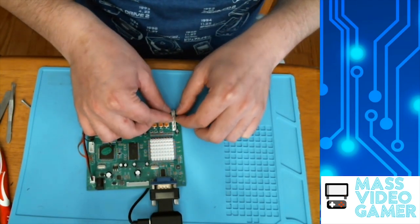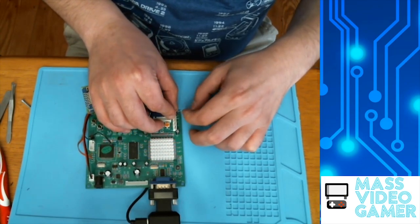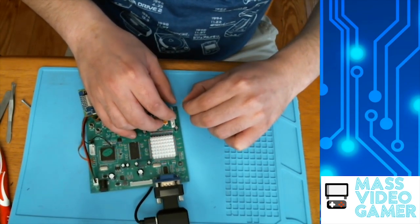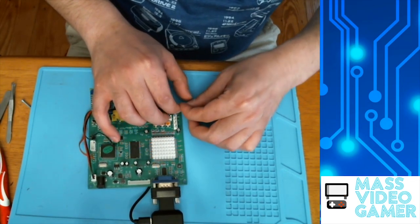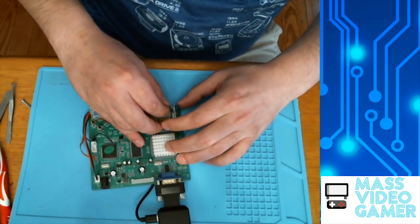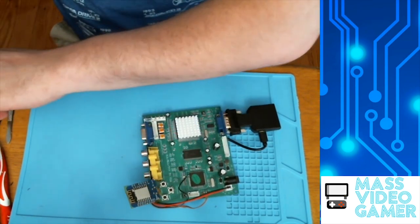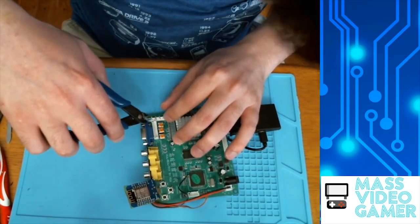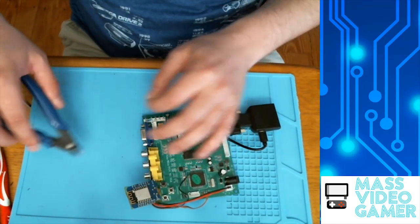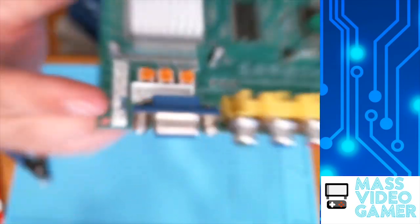What this does is take the actual sync line resistance and bring it down to 82 ohms. Normally for consoles you want to keep it at 75 ohms, but this is perfectly safe. There are two ways to do this: you can take a 100 ohm resistor and tie it around the ground and the sync leg on those pins sticking straight up, or you can solder those legs in place. The biggest difference is that if you're using something that doesn't need 75 ohm sync, you can simply take off that resistor since it is just used as a jumper between ground and sync. Now the RGB input is safe to use with consoles.